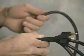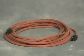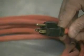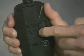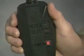With electric models, check the power cord to make sure there are no cuts or frays, and make sure the grounding prong is attached. Plug the electric jet into a 110-volt, 20-amp grounded circuit. If the power cord supplied is not long enough, use a heavy-duty, 12-gauge, three-wire cord in good condition — no more than 50 feet in length. Before each use, test the ground fault interrupter by pressing the test button, then the reset button. If the light comes on, the circuit is grounded.